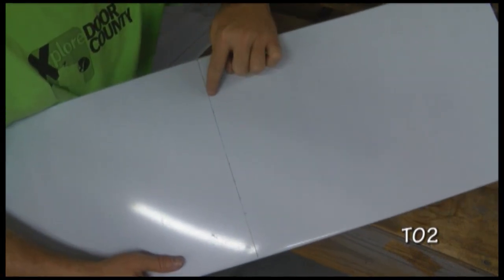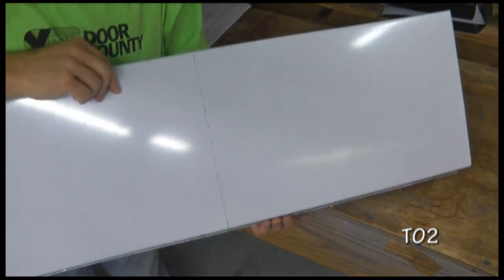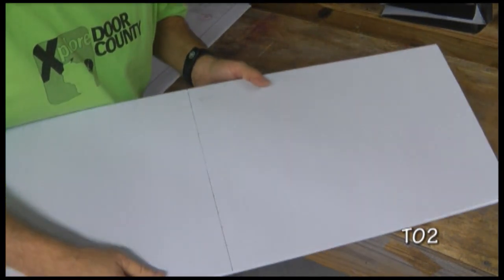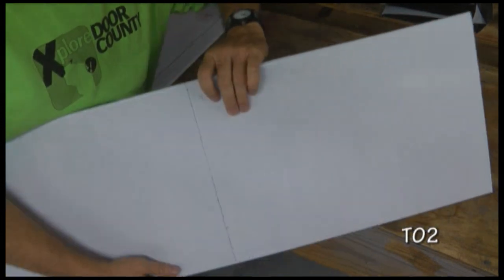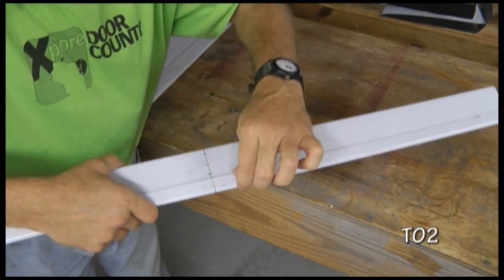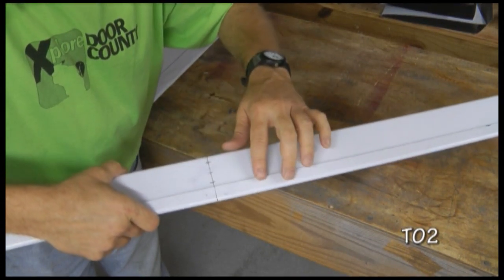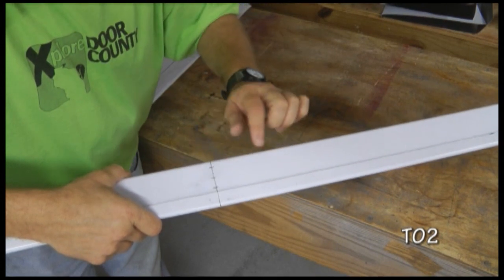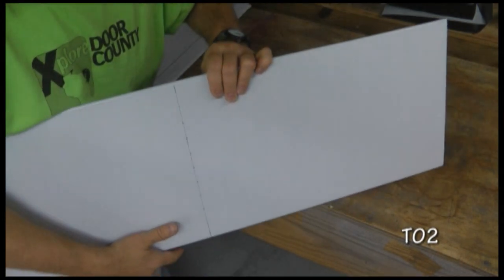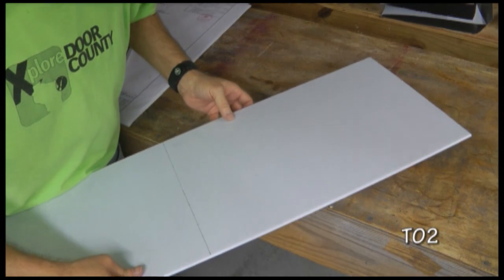But basically these were 1 inch apart. And so I'm going to drill with my number 40 drill bit at each of my rivet locations all the way around. The only one I'm not going to drill is the one on this edge here, because the hinge is going to go here eventually, so we'll leave that one rivet here undrilled. But I'm going to go ahead and drill all the other marks. That's all laid out in your plans as to where those marks are located and how many.